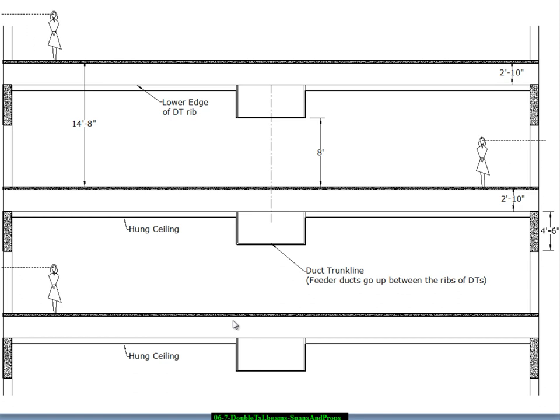So we have an incredibly simple building: a series of columns, spandrel or girder beams, and double T's spanning the full 60-foot width. However, there are two problems with this design. One is you still have to enclose the ends of the double T's, requiring some kind of facade structure. The second and larger problem is that the spandrel beam is blocking the light — you get good views toward the ground but not the prime daylight you want. That spandrel beam is getting in the way, so we need to talk about what we can do about it.